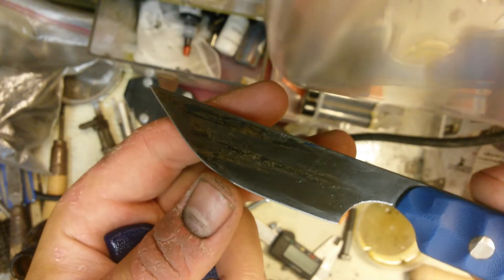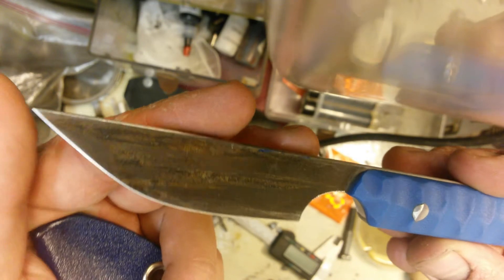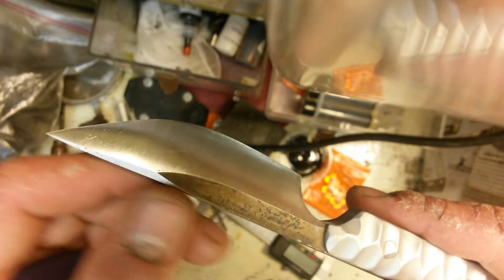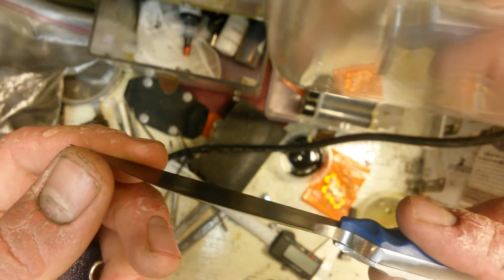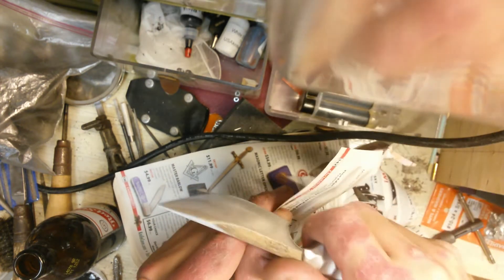This one's chisel ground. It's got fire scale on this side, which I think is really cool — it's a nice tiger stripe pattern almost. Then just a chisel ground on this side, with heat scale. It's got a little tiny swedge and a convex grind with a secondary bevel on the back side. It's actually really, really sharp — it cuts really well. You can see it's quite sharp even cutting at these weird angles.